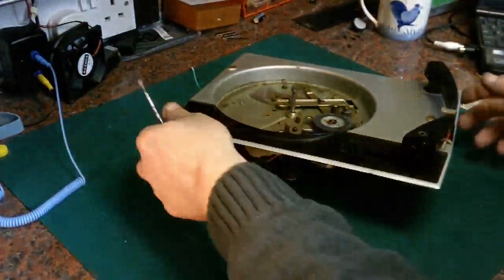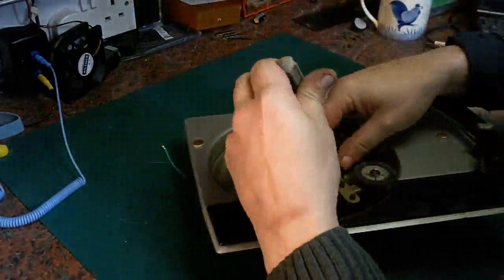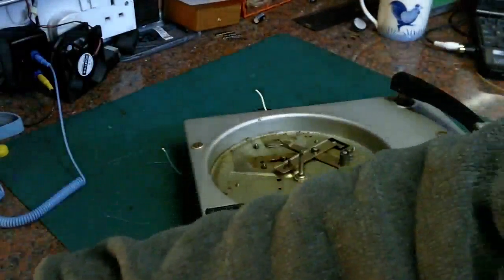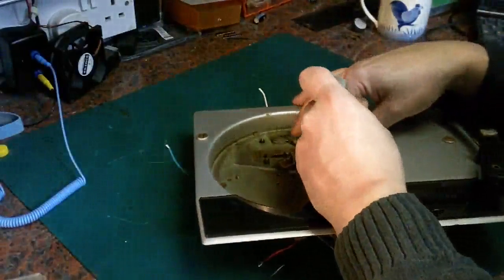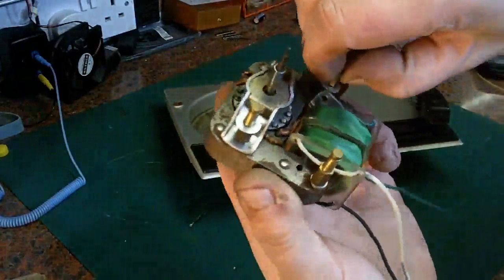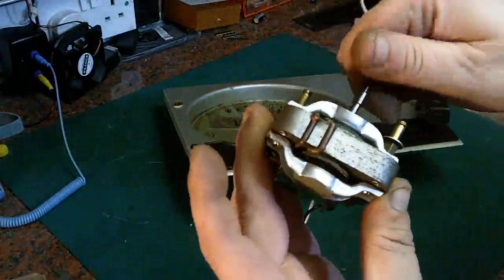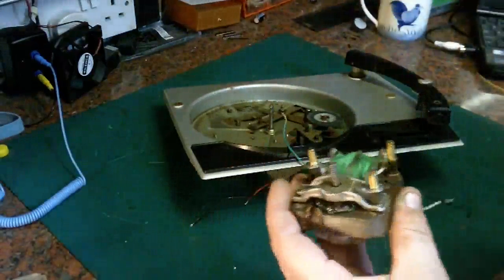We are on to the deck here now. What I think we will do — first thing I want to do is take the motor back out. I know we've only just fitted that, but that was just to see whether it would actually play. I did say back then that we would be taking the motor back out again. We will actually strip down and go over the motor as well and give that a proper lube up. It's not actually in bad condition — it does spin nice and freely — but we'll probably just go through it, take the back bearing off, and drop a little bit of oil in there and in the front bearing as well.